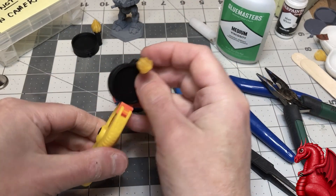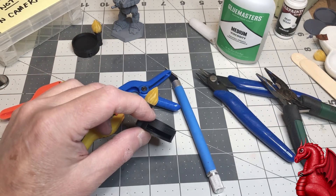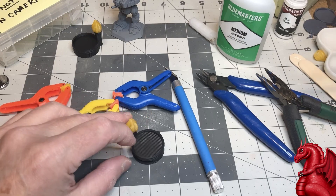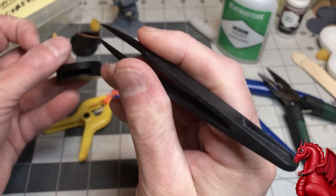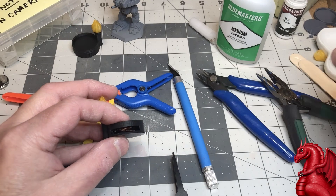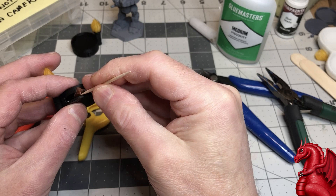Coming back — it's dry, I'm removing the clamps and everything looks good, nice and tight. Now we proceed to the next stage: applying a couple pre-cut swatches of copper tape to the bottom lead where it's in that trench. I have one cut and I'm going to use some tweezers to insert it. You just want it on the tip because it's very sticky and will stick to whatever you use to insert it, so try to have minimal contact.